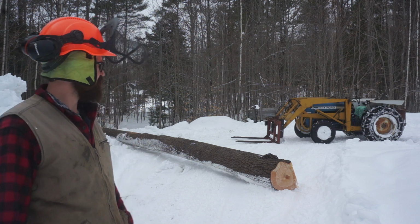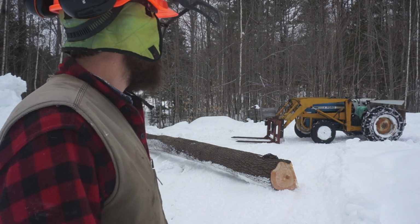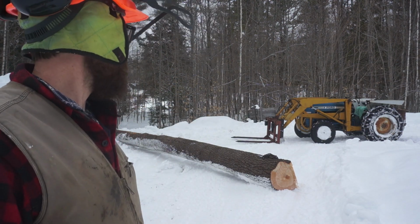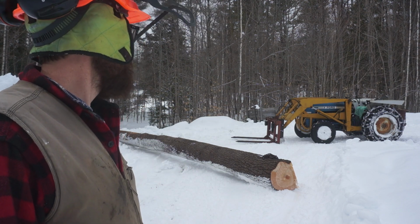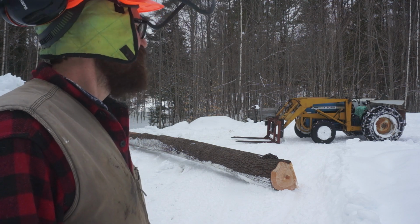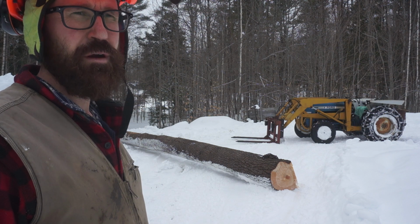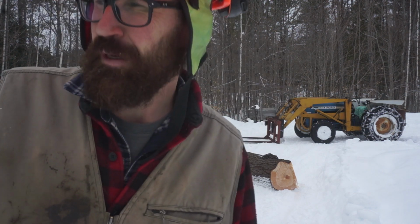You know, I don't have the winch, like I said, and I'm using the counterweight with the little hooks on it to connect my chokers to. Then I lift it, so I lift the front of the log up. Gives more weight on the tractor, on the rear tires with those ice chains. Even through this heavy, crazy snow, that two-wheel drive is 50 horse diesel, so that's really good. Unfortunately, it's got a fuel pump leak, but I've got the kit on the way. It should be arriving any day. It's got like 1,000 parts. It's going to be fun to rebuild that thing. So I'll film that for my own good, but all right.